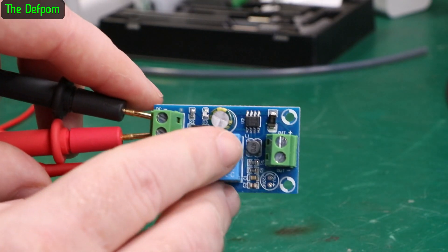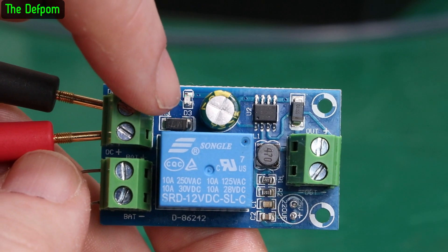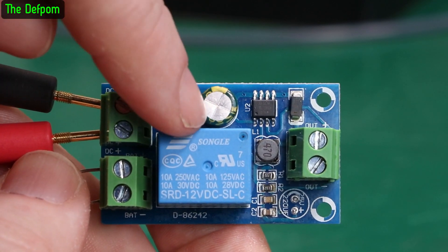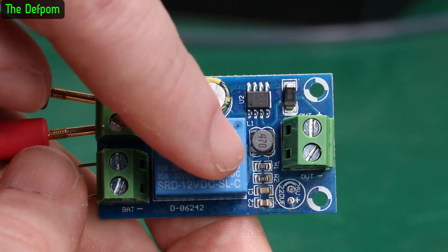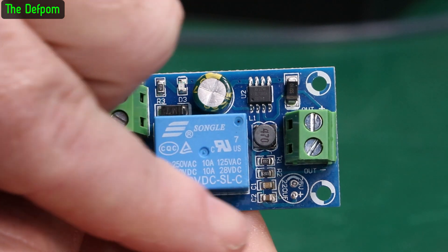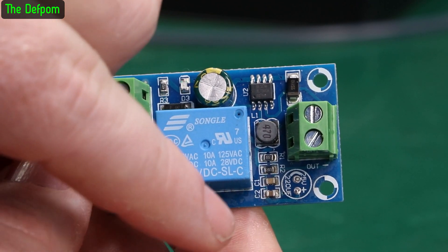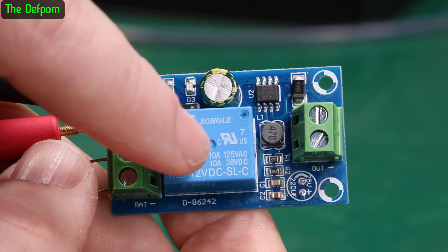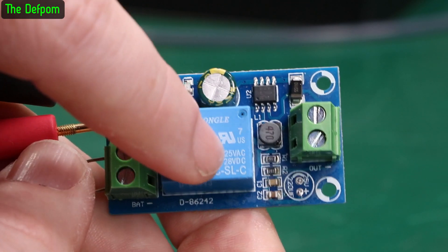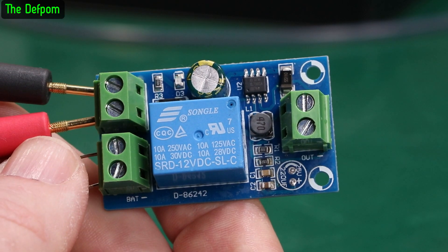So basically what we've got on here is a little buck converter chip. Power comes in, goes through that diode, into the power supply capacitor which is running the supply for this chip here. This chip is then running this little buck circuit here. That capacitor is normally across the output, which has also got these other smoothing caps across it — the little ceramic ones. There's a feedback circuit that goes back to the chip so it knows what it's doing. And then that supply is actually feeding this relay. So this capacitor is across this relay coil — and 220 microfarad, that's a fair size.